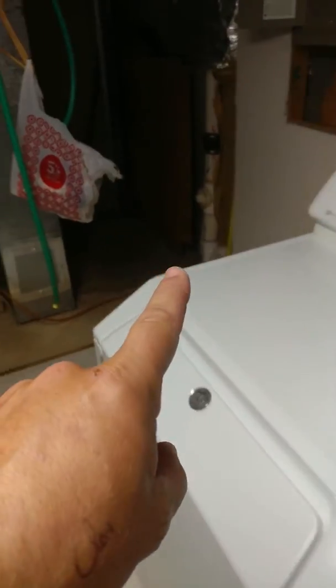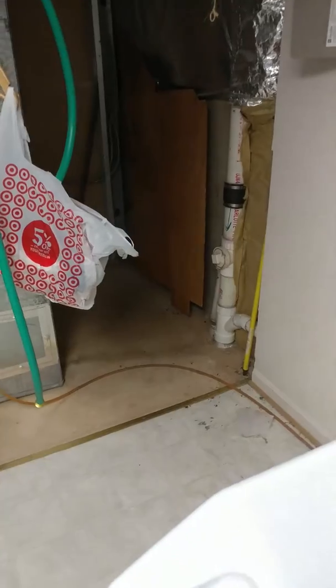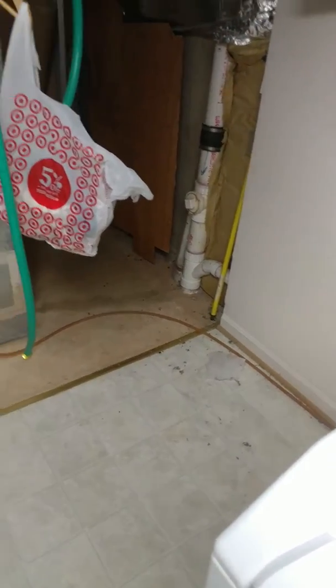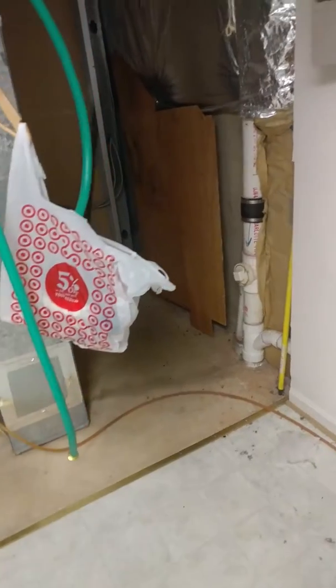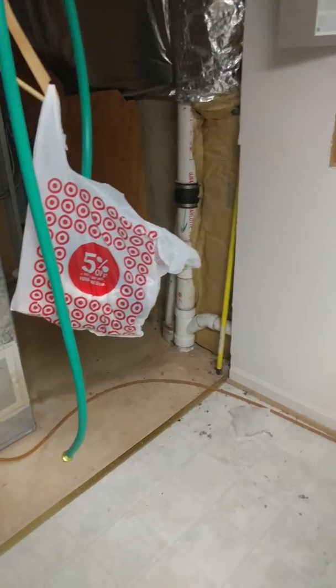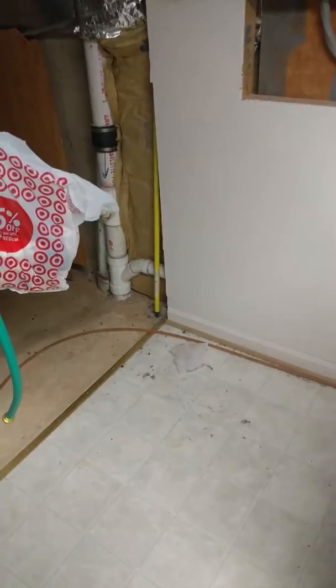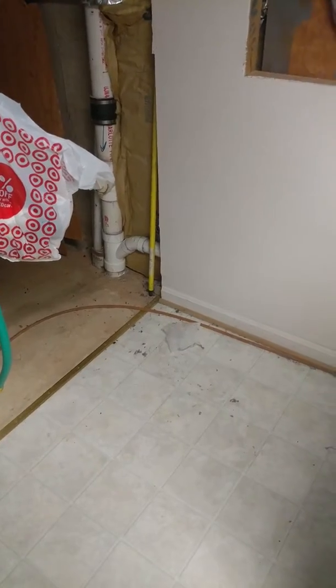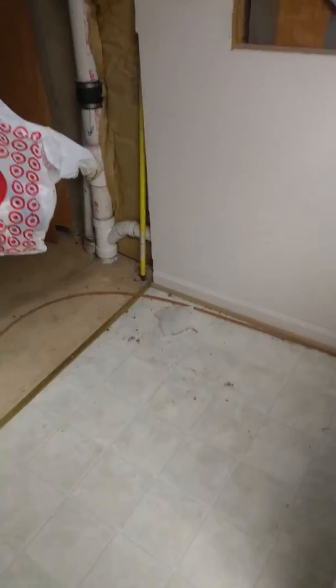As you go through here, there's a main sewer stack right there and there's also the drain tile. The stack should be deeper than what we're going, but we're plumbers — if we hit it, we can fix it. Same with the corrugated drain tile: if it's broken, we can fix it; if we punch holes in it, we can fix it; and if the grade is bad, we can add gravel underneath to correct it.